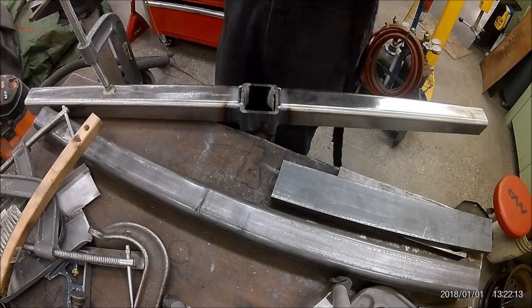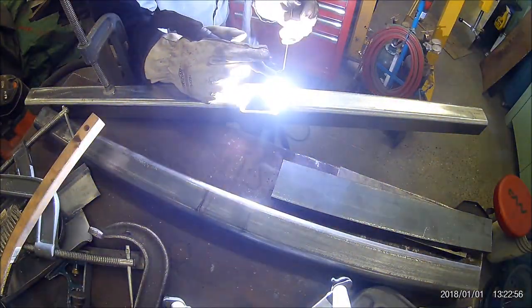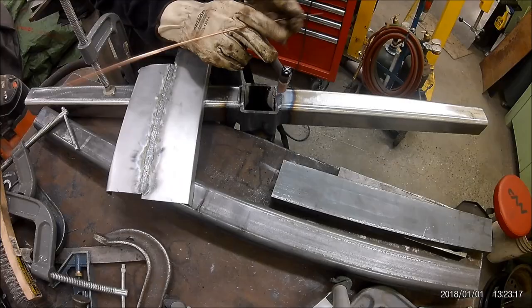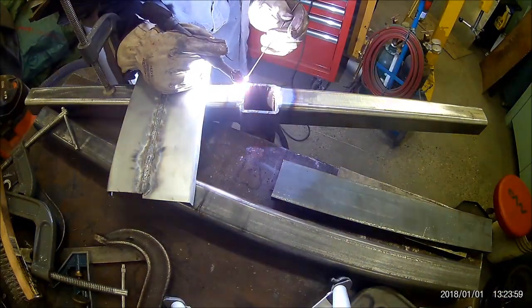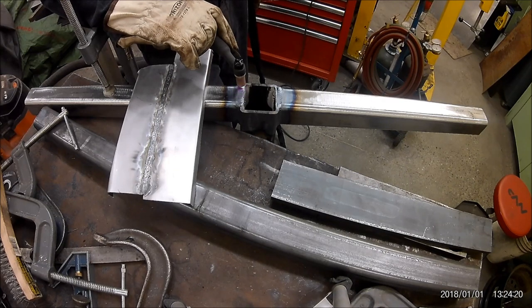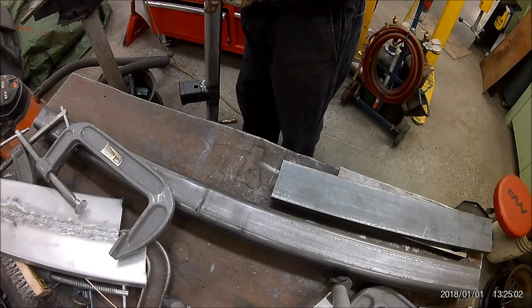And then often I give it a splash of lacquer thinner, or if I'm feeling saucy, acetone. Never brake clean. Brake clean, especially chlorinated brake clean, has wonderful chemicals in there that will kill you. Lucky you. If you find that it's killed you, leave a comment.